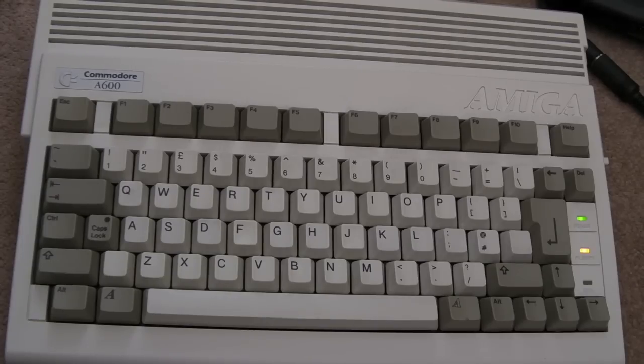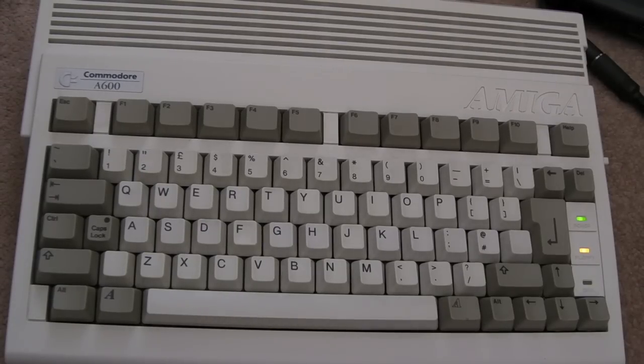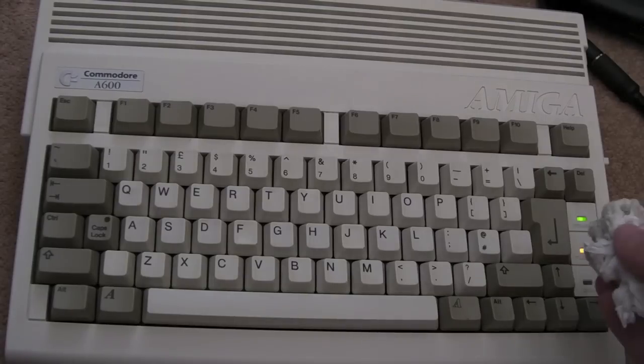And then when you switch it off and on, the same sort of thing. I think it was like 50-50. You'd either have a 50% chance of getting the red screen or 50% black screen, it wouldn't do anything. Switch it off and on again, and then it would boot. So that gives you a clue that it's certainly something timing related and something that is occurring at the start of things, when you first power it on. Hence why we started looking at the reset. And that was my very first thought when I saw the behaviour: I think it's going to be a reset problem.